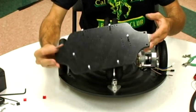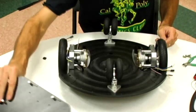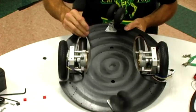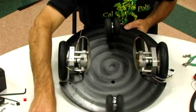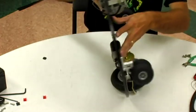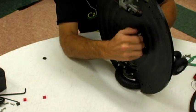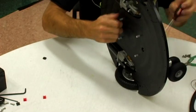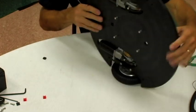Jessica's already got the battery tray assembled, but before we put that tray with the cells onto the base of Eddie, we first have to mount some standoffs for the control board. Right here in the middle there are four screw holes. We'll put these 4-40 by 5/8 long pan head black screws through those holes, then add these 5/8 hex female-to-female standoffs and use a little Phillips screwdriver to cinch them down nice and snug.